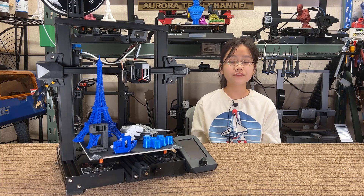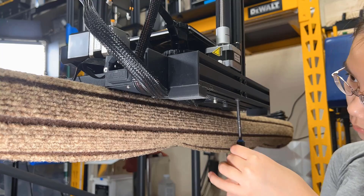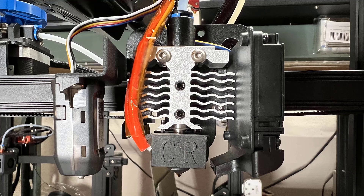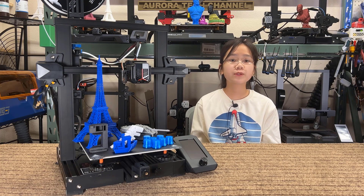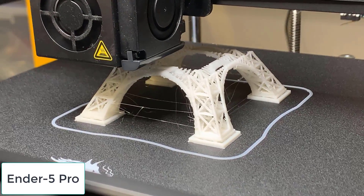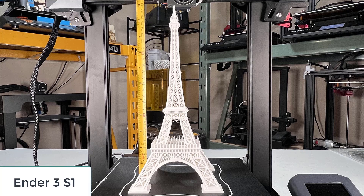Let's talk about the pros and cons of this printer, starting with the pros. First, the assembly is easier than the Ender 3 V2 — the entire gantry was pre-assembled, saving you 15–20 minutes. Second, the new hotend seems to work better: the larger heatsink fixes one of the most common issues in the old Ender series, especially for a Bowden setup that requires more retraction distance, which can cause filament clogging. Third, on the stock Ender 3 and Ender 5 I could not print the Eiffel Tower without clogging, but on this Ender 3 V2 Neo it seems just fine — as a Bowden setup it won't print as well as the Ender 3 S1 with a Sprite direct drive extruder, but it can at least finish the print.